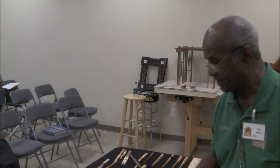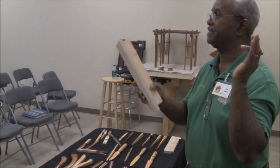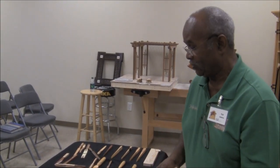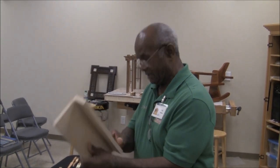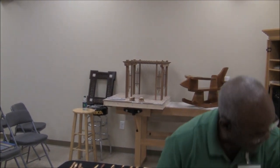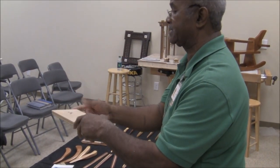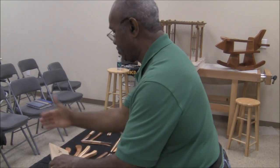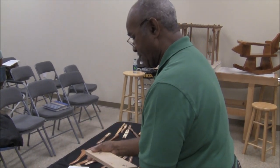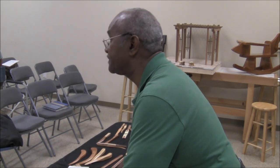I can cut any angle I want on my table saw. My regular miter saw will stay at 90 degrees. I never change it. And I can cut boxes out, I can do whatever, and it'll be at the same angle. It's got two-sided tape on it. If I want to cut something at, say, 45 degrees, with my miter saw set up at 90 degrees, all I do is pull my saw out and put this up against the blade. That sets my angle. This is my 45-degree angle. Now, I can slide this in. So this is now set up at 45 degrees.